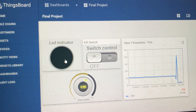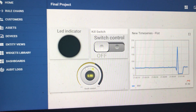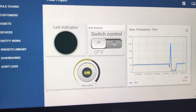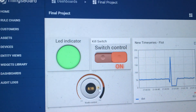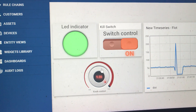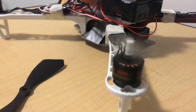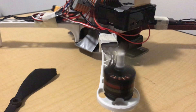So let's go ahead and turn on the motors. It's going to start at a lower speed of six, which ranges from four point five to ten as max, and four and a half duty cycle is the min. Let's turn them on — you can hear them all turn on, you can see the tape going. Let's increase the speed — speed is faster. Let's go to max. And now all the way back down to low. So this is faster, max speed, and now back down to 5.5 duty cycle.